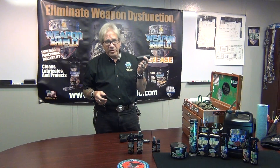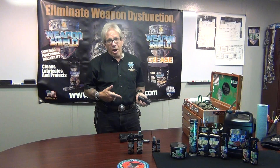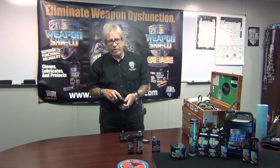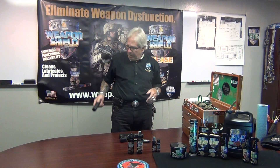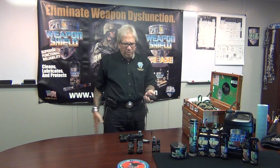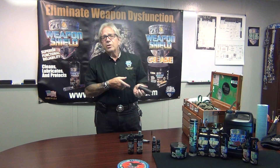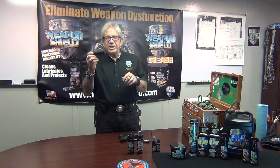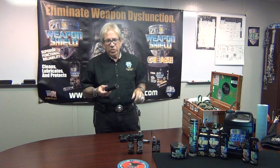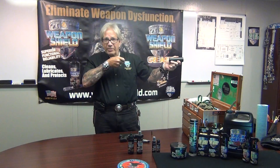Keep in mind, that grease has a 575-degree dropping point. So if your suppressor is on an M4 that you're going to be rocking and rolling full auto, you're going to heat it up pretty quick. But if you're using it on a sidearm like a .45 ACP or a duty weapon and carrying a wet can, you don't have to worry about it dripping out on your uniform or leaking all over the place. It's going to take quite a few rounds from a single semi-automatic to get that can up to 575 degrees. Of course, everybody's seen the video of frying bacon on a suppressor — that's a different story.